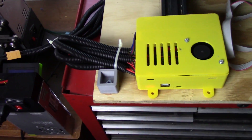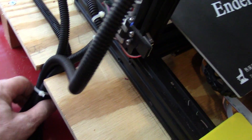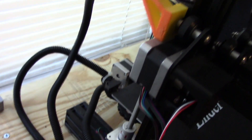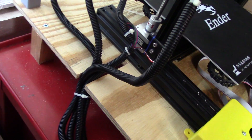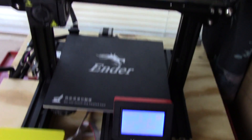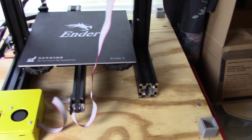I came back and lengthened all the wires and encased them in a 3/8-inch accordion plastic wire loom to kind of bundle them together. Of course, they're never going to all be the same length unless you modify those ribbon cables yourself, and I'm not quite ready to go there yet. I also got a longer ribbon cable for the LCD — it's now long enough to go up on top of the enclosure where I want it.